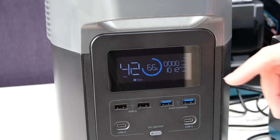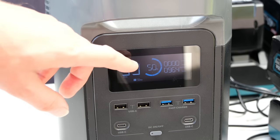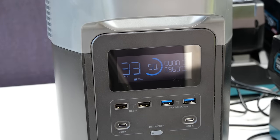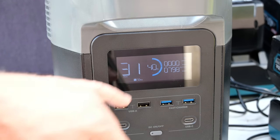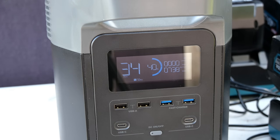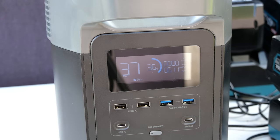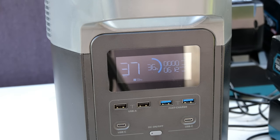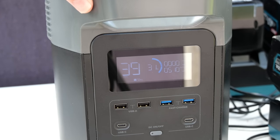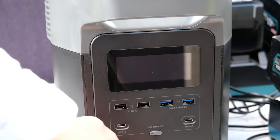The 12-volt battery is charged. We've got about 42 minutes left running and 65 percent of the battery left. EcoFlow is now down to 50 percent capacity, and the 18-volt batteries are nearly charged — watch this number drop when the 18-volt batteries kick off. The 5 amp-hour 40-volt is almost charged as well, and we're getting a drop down to around 800 watts. With the 12-volt and 18-volts now charged, we've got 600 watts going out to charge the 40-volt batteries. Just the two 8 amp-hour 40-volt batteries left charging now, and as long as they charge within 39 minutes, we'll be good.